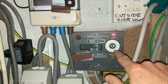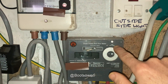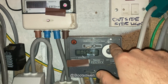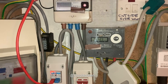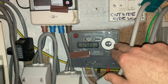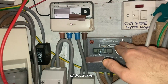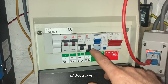Right now we're making about 300 watts of electricity and we're using about 50. You can see on this meter here it's changed — something's come on, either the sun's gone down or something has been turned on in the house. We're teetering at the edge here. When this light is solid it means we're exporting; when this light is solid it means we're importing. How quickly this light flashes shows how fast we're importing.